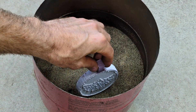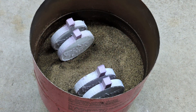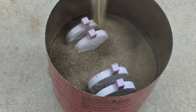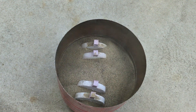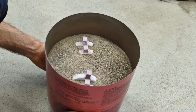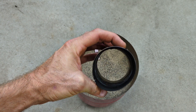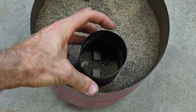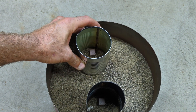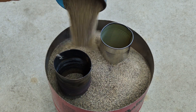You can see the way I'm placing these in the container — I'm doing this because I'm using two pouring basins for this pour. As you probably saw in the first ten seconds of the video, I wasn't really sure how I wanted to do this. I figured this is probably the easier way instead of me gluing more things to the foam, like adding a screw to it. These are just cut right out of the polystyrene foam and ready to cast. Make sure you vibrate it while you're filling it and vibrate it once you get to the end. This here is the pouring cups I spoke about, and you can see how I'm surrounding two of the foam patterns with one can.